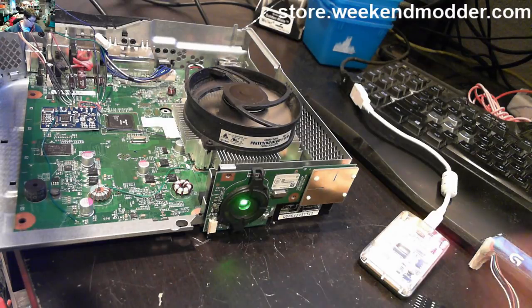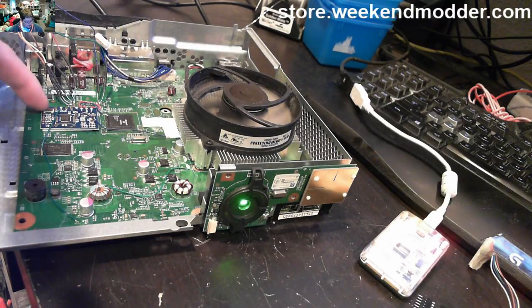Results are in — I'm really digging the muffin install on Coronas. I think I may stop using ACE v3s on Corona and exclusively use the muffin here. I'm going to push forward with trying to get some 100MHz crystals, and if that improves things even further it would be amazing. I might end up with the Matrix being the only chip I use — RGH 1.2 on fats, and muffin on slims and trinities. Thanks for hanging out with me — fun time as always, have a good day.